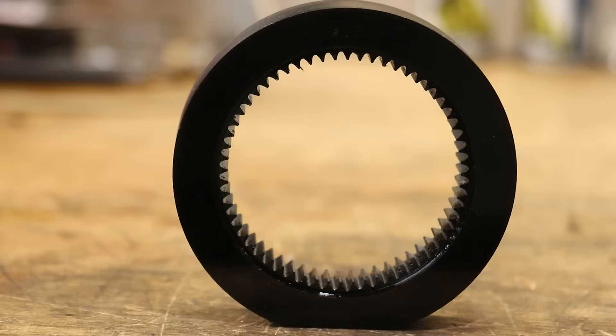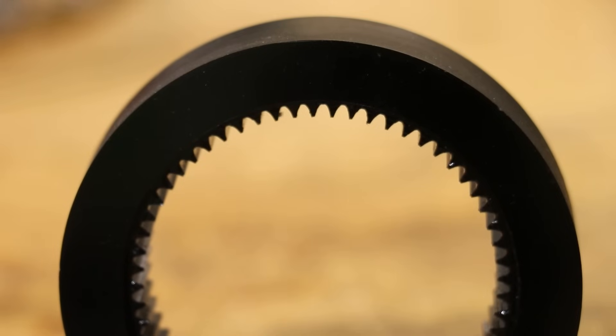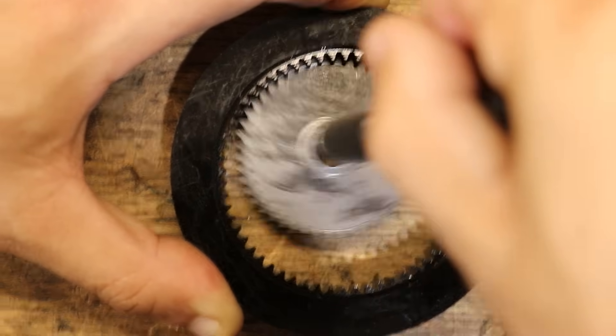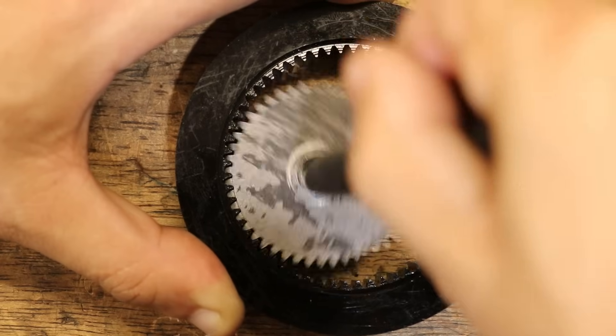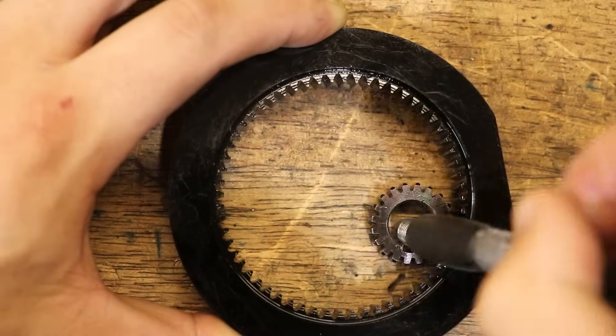That's our 60-tooth ring gear now made. It came out looking a lot cleaner and more consistent than the 100-tooth one did. The teeth definitely look a lot closer to what you'd expect an internal tooth to look like. With that said, I still think the cutter is a little bit wide and those gear teeth look a little bit thin for my liking - there's still a little bit more material that could come off the bottom of that cutter. But as a proof of concept gear, it's working really well - good movement between those gears, no hard spots, and no interference.